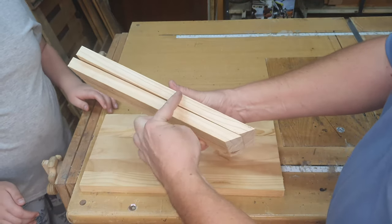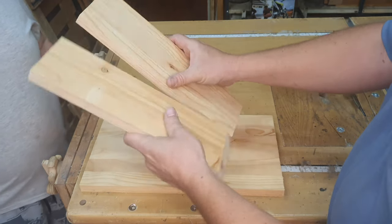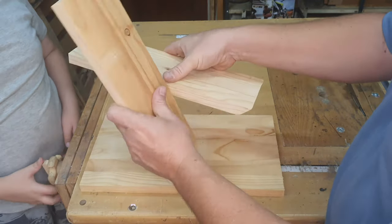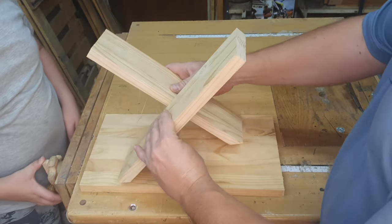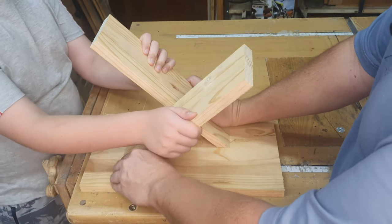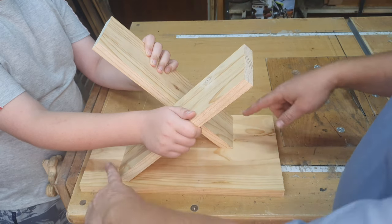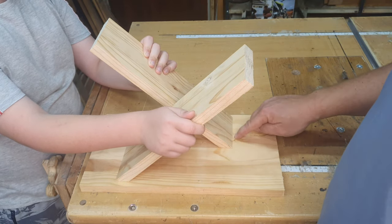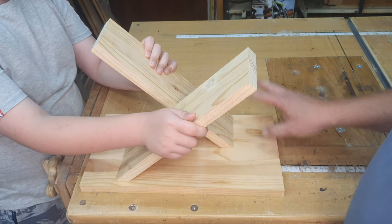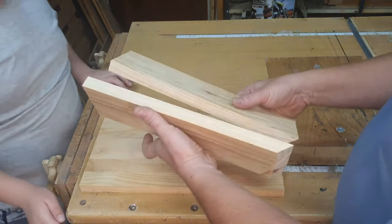At the crossing point I'm going to drill a hole into each of them where they'll sit against each other, and then I'm going to put a piece of dowel stick in those holes to give it extra support and glue it in place. When it's mounted and glued in the middle where the dowel is, I'll use wood glue and screws from the bottom to screw the uprights to the base and wait for it to dry — that will make it fairly solid and steady.